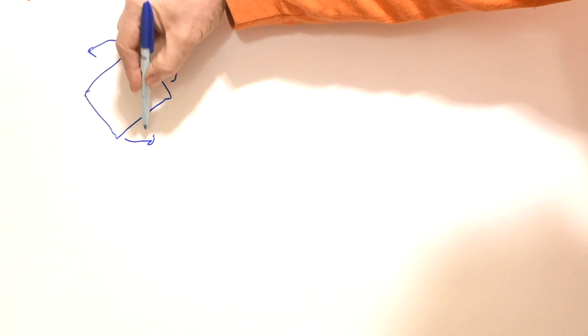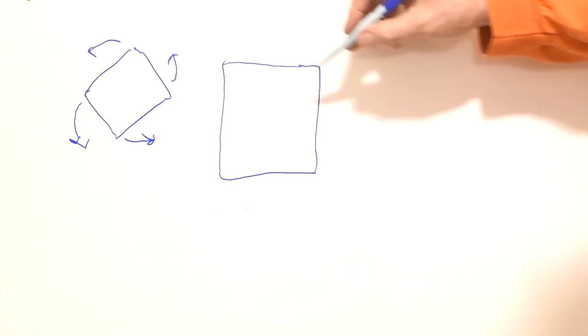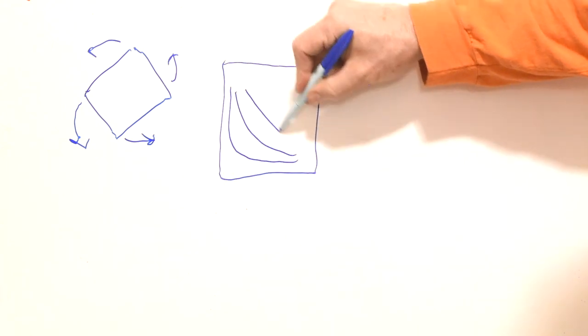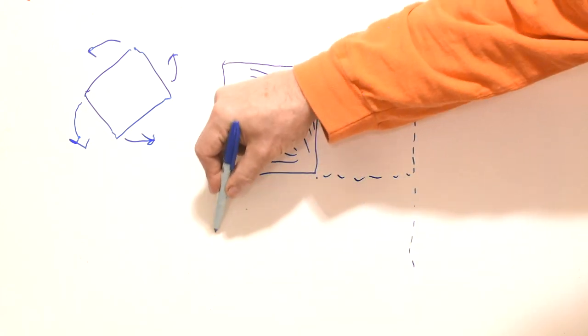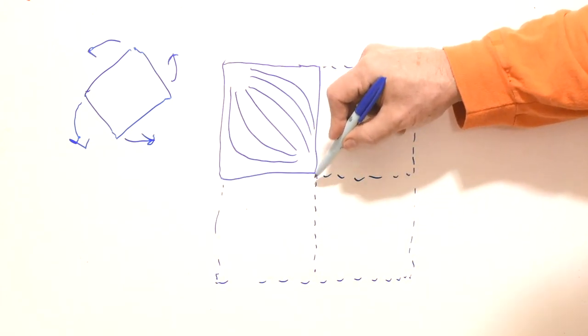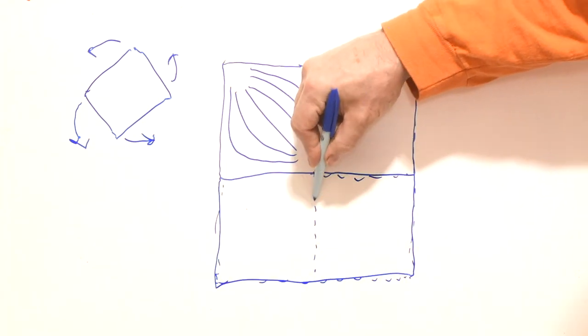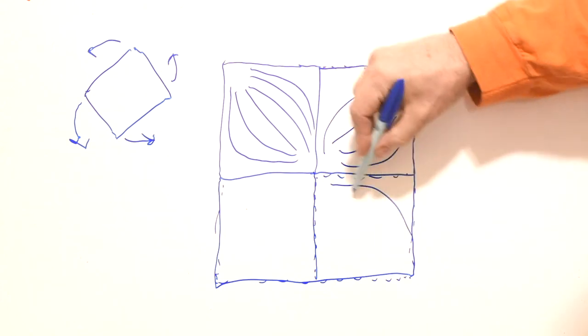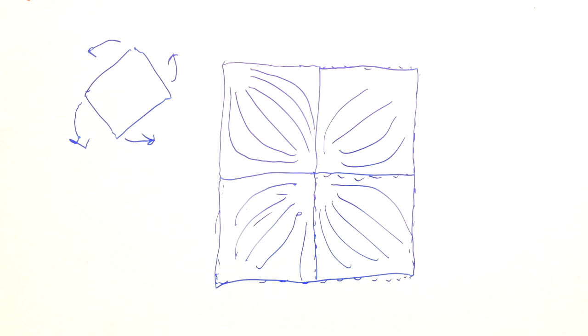So here's the main trick with Mosaic Damascus. Once you establish a pattern, you'll draw it out, then restack and re-weld the layers. Now the pieces of the original pattern will sort of connect up with edges from the adjacent pattern and form additional larger patterns. One of the foundations of many kinds of mosaic Damascus is what's known as crushed W's. Because the way these little curved lines connect up, they form what look like little running sets of W's. But that's not really what we're doing here, though.